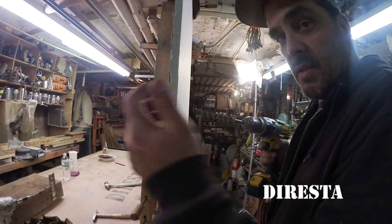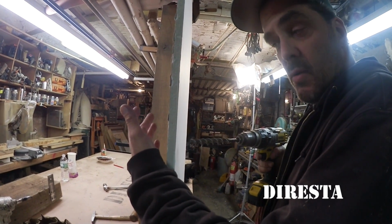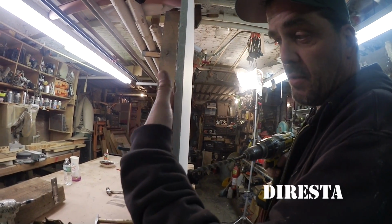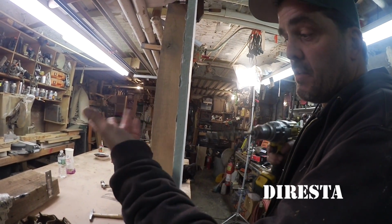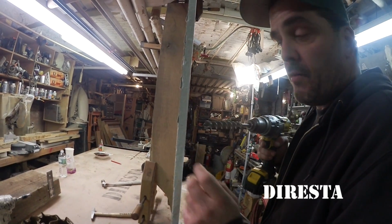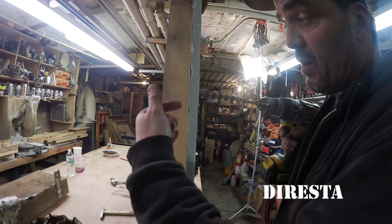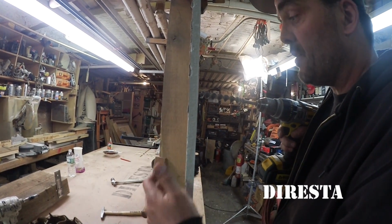A lot of times when you're drilling at the sheetrock, you hit insulation on the other side, or if you're close to an exterior wall of like a New York City building, you'll hit brick, which is usually 2 inches on the other side of the sheetrock. So go in slow. Don't go in with full force because you'll ruin your bit. You don't know, you could hit a wire, you could hit a pipe. I'll show you how we cut open the sheetrock to check and see if there's any plumbing on the other side.